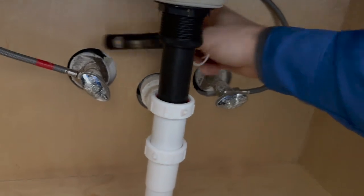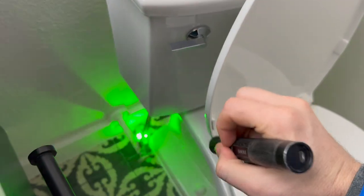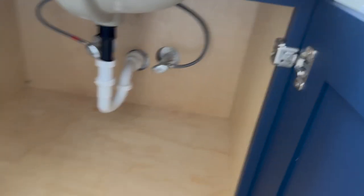Here's something else I noticed on the structure. Underneath the sinks and the toilets here, we have old galvanized water lines. It's something we really want to keep an eye on — check our pressure levels and see if we can see anything in the attic. Galvanized water lines are an older system, and Houston's water is so hard and heavy it ate up a lot of our galvanized water lines. They only really lasted about 50 years, and if this is a 1960s home, it's way past its lifespan.